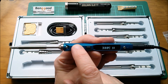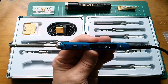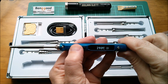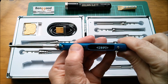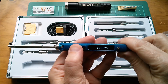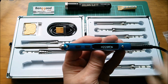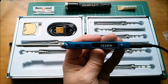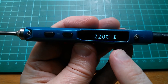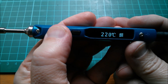So are these the up and down temperature buttons? Buttons don't look like it — read the manual time. Press and hold this button — it's now going down in 10-degree increments. Solder melts at about 180, so let's set it to about 220 and see how we go. There's quite an interesting graphic on the side showing a tip with squiggly lines that I think means steady-as-she-goes.